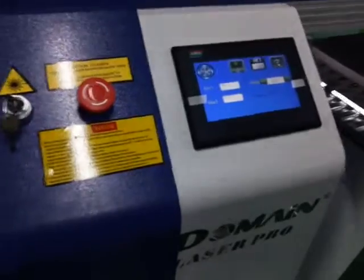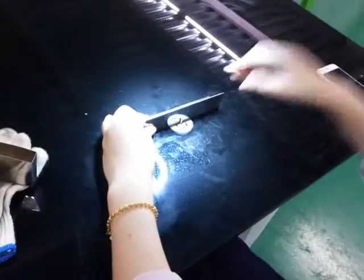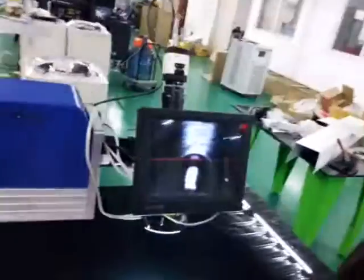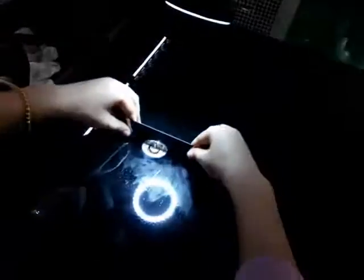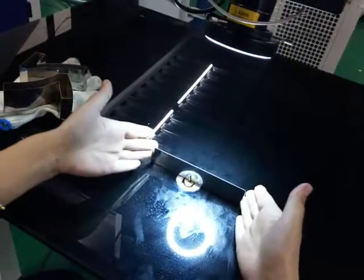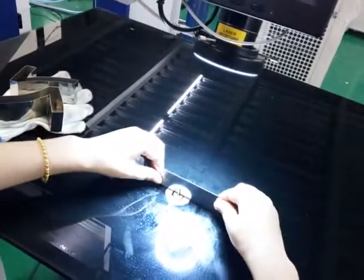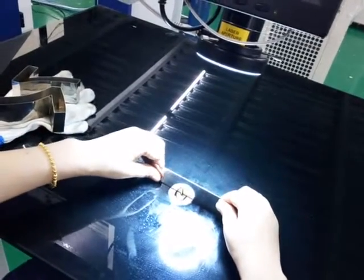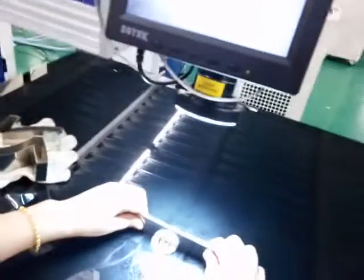Now the charging has already finished, so it is ready to work. You will see a red crosshair on the monitor. Put your material towards the locating pin and try to pull it towards your body. It gives some pressure on the material so that the side coil and the front plate can touch each other very firmly. Now you can see the line to be welded is overlapped with the red crosshair. The position is ready.